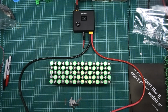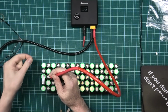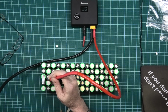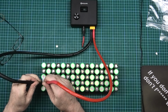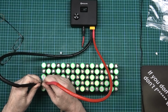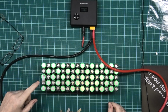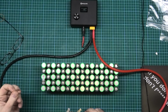Here we go. You see this magnet here, look. I'll put the magnet there. I'll put it there. Watch it. They dance around because of the electromagnetic field. What I'm doing at the minute is testing the pulse width. Around about 12, maybe 14 milliseconds, because this is actually 0.3 mil nickel.